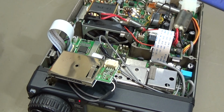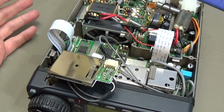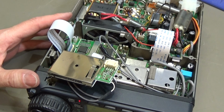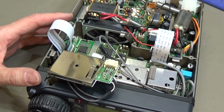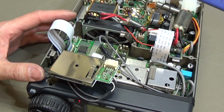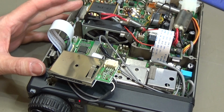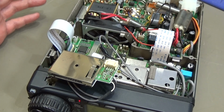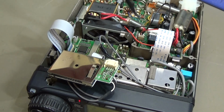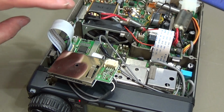As this radio came in with no receive indication, and well, I thought that might be one of these boring faults, and not really interesting to share. But then when I started our troubleshooting, I recognized that it is more than a boring fault. It is really a PLL problem here on our PLL board, and what you are looking at here is already our PLL board.